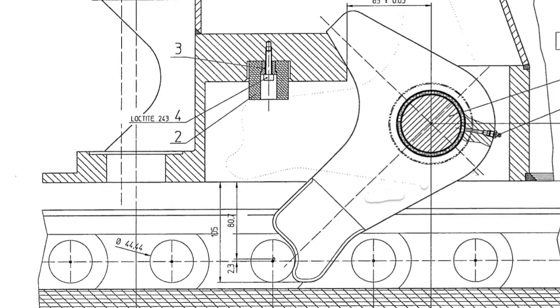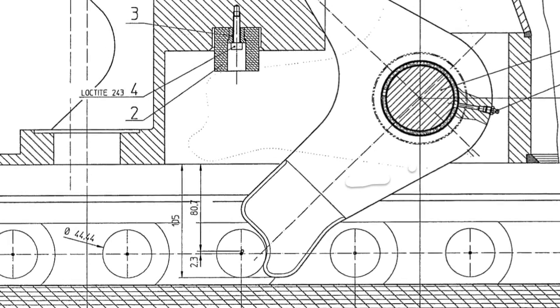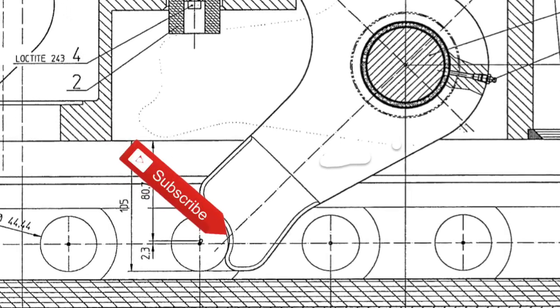And basically as it comes up to those links like this, the dog comes across it, goes up, and then falls back down. And then the train rolls back a little bit, and then the chain is free to push it up the lift hill at that point once the dog bites in. Dogs are typically positive engagement devices, which means that when it bites onto that chain, the more pressure you push on it, the harder it wants to try to pull itself down into the assembly. So it's not something that, if you push too hard, it simply just comes undone and flops out. That's typically not a thing, unless you've had some sort of catastrophic failure, which isn't good.